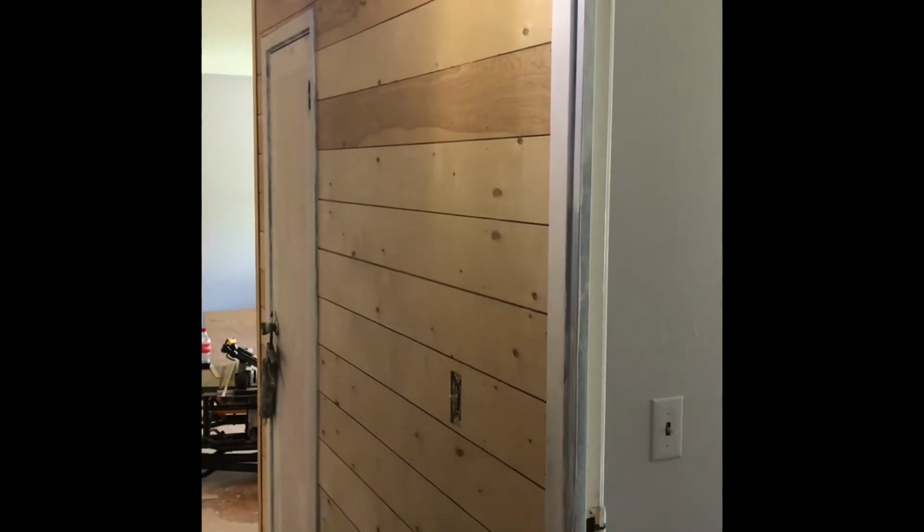All right, so all the shiplap is up and the corner pieces are applied. All it is that same 1/4 inch, just formed a corner out of it. There's 3 outside corners. You can see obviously the previous wall color underneath, but what we'll do is we'll do a base coat of gray and do a white paint over top to give it that distressed look, and that'll fill that in so you won't see that color any longer. So getting ready to start the base coat.